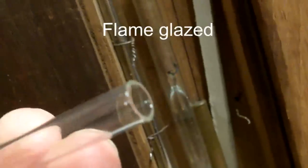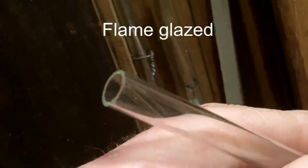It had started to draw its vacuum and now I'm just putting it back together. I haven't topped up the mercury yet — that's the level it's at. I'm going to put the float in and put this tube in — it's a guide for the second float. That end's been flame-rounded whereas the other end has a sharp cut end, so I'm going to have the rounded end pointing up so that the little bit of silk or cotton goes past a polished edge. I didn't notice that when I took it apart, but that makes sense.